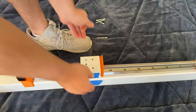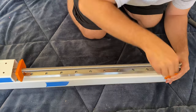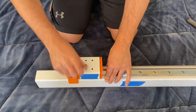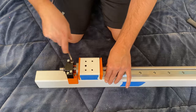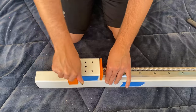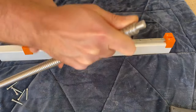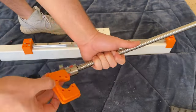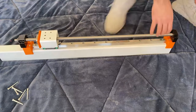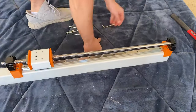Take care with the direction you're mounting the rollers — there's a proper orientation and you want both to face the same way. I messed this up; it's not a huge deal, just take it off and put it back on the correct direction. Once you're comfortable with alignment, bolt them down to your Y frame, tightening in an X pattern so you don't over-tighten one side. Also — if you have two-by-three steel tubing like I do, make sure to thread your ball screw through the roller before putting on the end blocks. I didn't, and had to remove an end block, thread it through, then reattach.